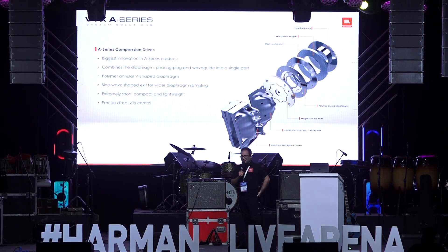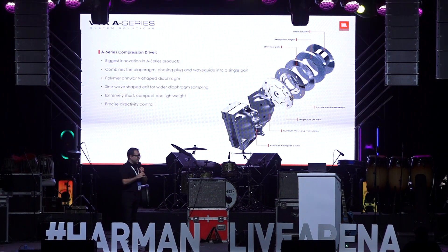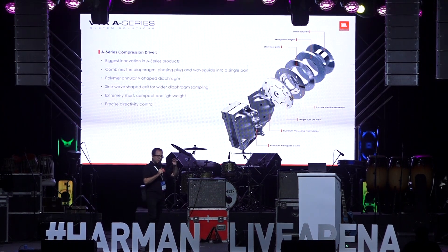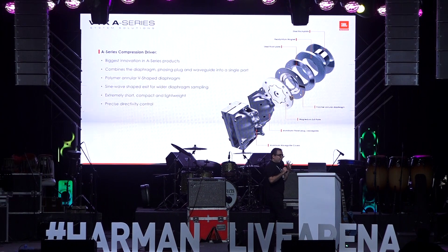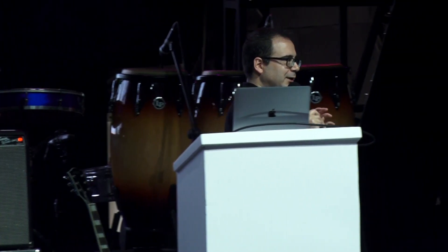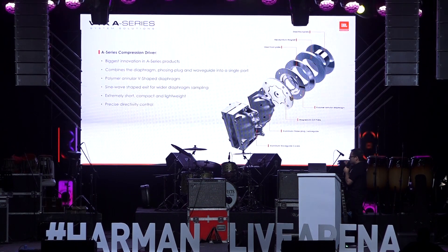What makes the A series a very strong family is the high-frequency compression driver. A lot of what gives line arrays their character in terms of sound comes from the compression driver. Usually all of the things we tend to like or not like about systems is from one kilohertz and above, which means whatever character we receive from a sound system comes from the compression driver and its extension, the waveguide. With the A12, we redesigned the compression driver and waveguide system to use different materials — composite diaphragms instead of titanium and aluminum — giving it a much different character than traditional compression drivers. These new compression drivers use much fewer parts, are far more integrated, and because they don't use traditional aluminum and titanium diaphragms, they're much sweeter sounding and far less aggressive at very high outputs.